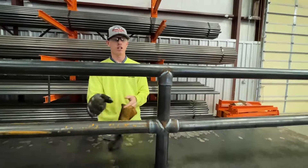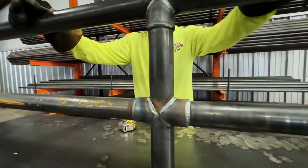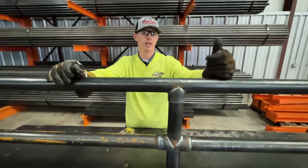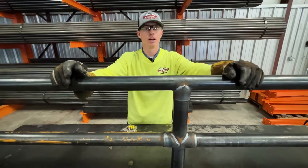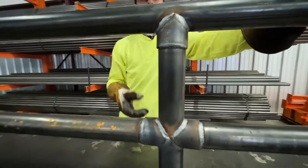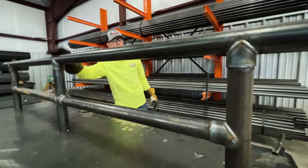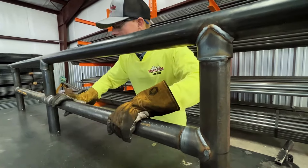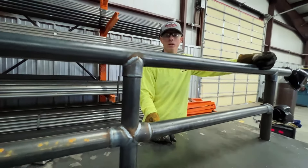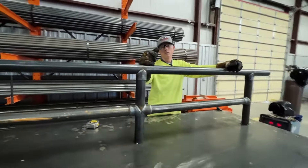As you can see here, we just finished it all up. I got it all welded and this thing's solid. This is a solid fence. I would definitely recommend using these Pipe Pals for any of your fencing projects, especially if you want to quickly saddle pipe. We've shown you guys a lot of different ways how to saddle pipe — this is a way to do it without having to actually saddle. Straight cuts, you weld it. You can just tack it if you want, but I mean, fully weld. This is a solid piece of fence even with these Pipe Pals, and it really doesn't look too bad — it actually looks really well. It all matches with the raw steel. So if you're looking for a way to easily saddle your pipe and build a nice pipe fence, Pipe Pals are a great option.